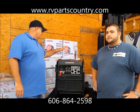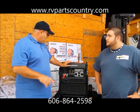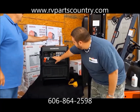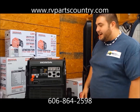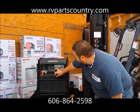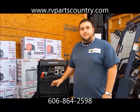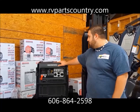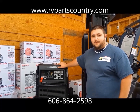We're going to turn it off. We do have fuel injection on this 7000, and you saw how quickly it started up for the first time. Richard, tell them about the panel. On the panel, you've got the parallel operation outlets — coming this winter, you'll be able to hook two units together for 14,000 watts, so you and a buddy with a camper can power two campers at once. You've got circuit protectors with push on/off, and a 30-amp circuit protector. Comparing it to the EU6500: the 6500 runs 14 hours on 4.5 gallons; this one runs 18 hours on 5.1 gallons — more fuel efficient. For another 500 watts, it's only 6 pounds heavier.